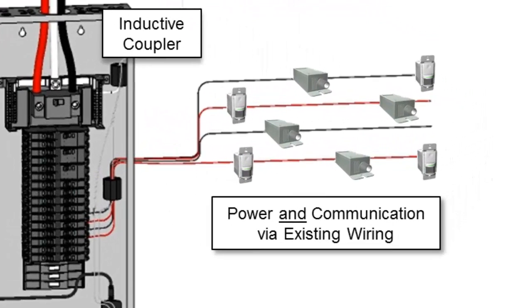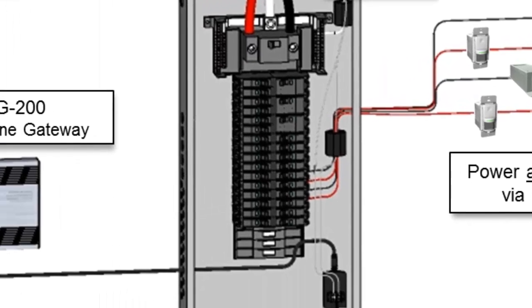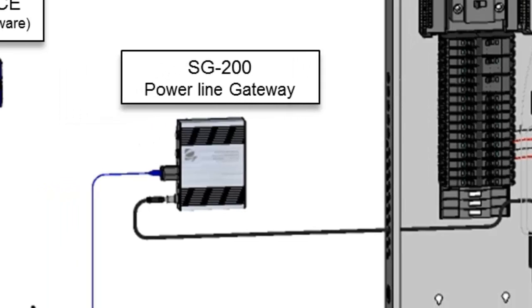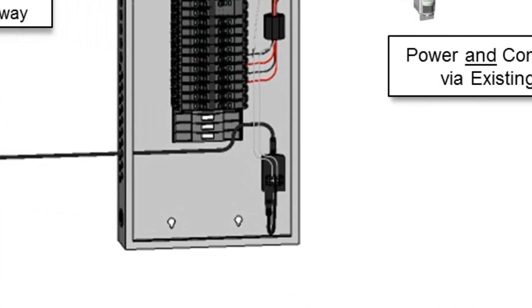Out here on the building's existing wiring, we install all the YWire devices. Each device has a MAC address just like your computer. How we induce an ethernet network onto the electrical system and gain access to its information is through a power line gateway. The gateway itself doesn't do much other than act as a pass through from BPL — broadband over power line — to CAT5. Here in the electrical panel, we use a coax cable and a signal connector to run our signal injection circuit. This is known as inductive signal injection.